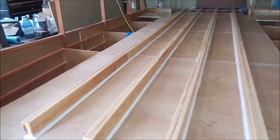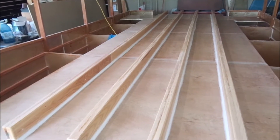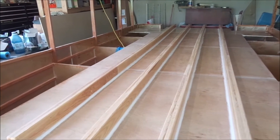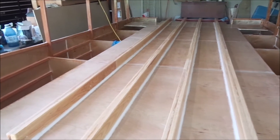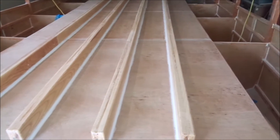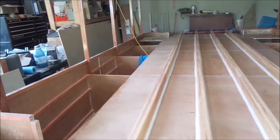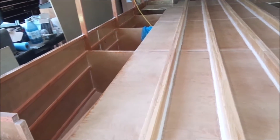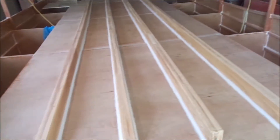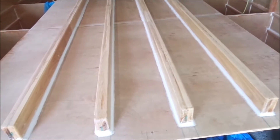The bottom of the deck has been fiberglassed and the stiffeners added and epoxied in place. The stiffeners are made out of ash — 13 feet long in a 2x4 configuration, laminated together, heavy and strong. I'm now going to paint about 80% of the bottom, leaving the edges unpainted since those will need to be epoxied to the pontoons later. That's the progress today.